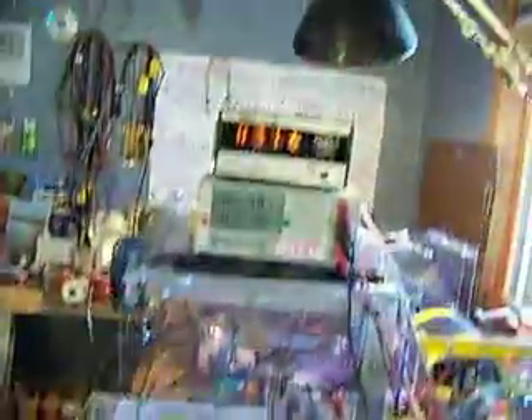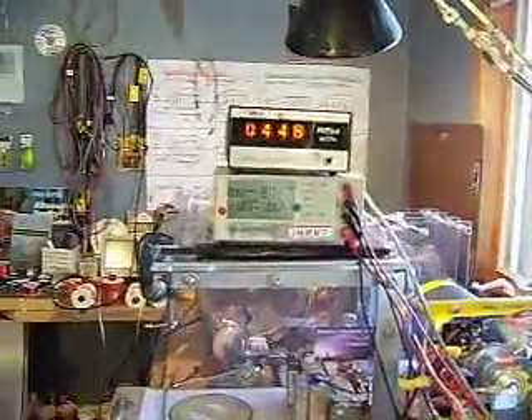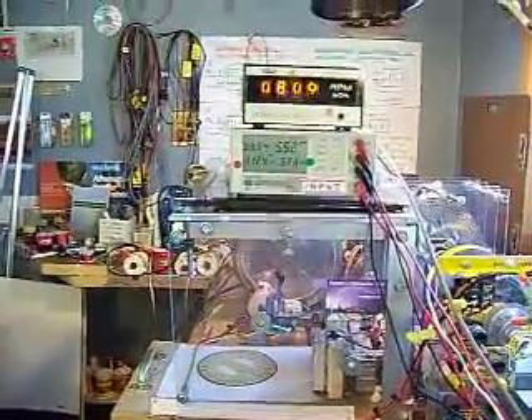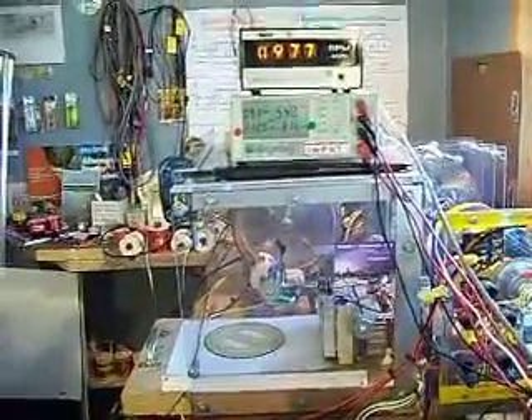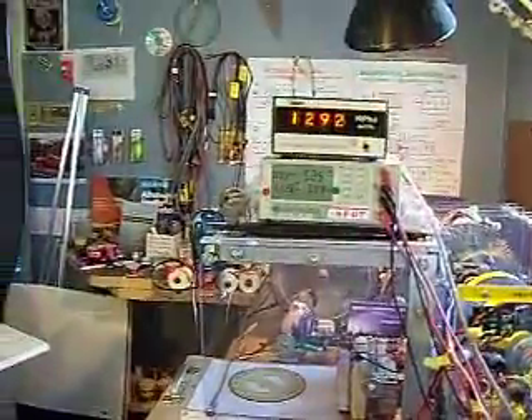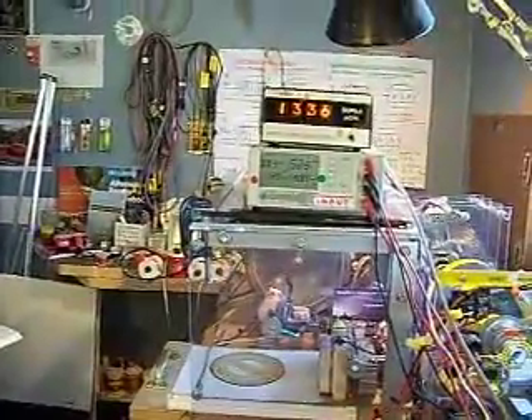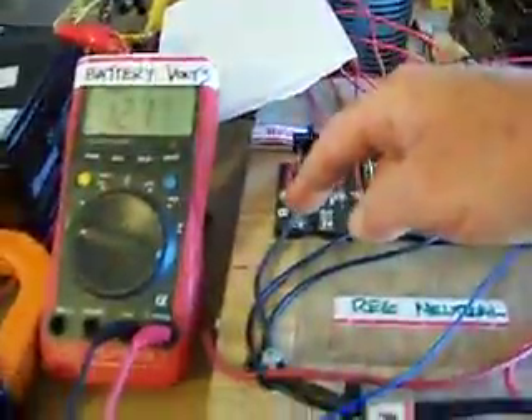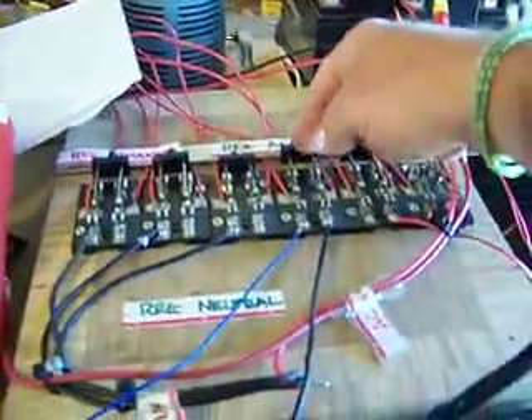So let's start it up. The operating speed I'm going with is 2500 RPM. You can go higher or lower than that, but I'm choosing that speed because it allows the motor to operate within its ideal current range. So let's take it up to 2500 RPM. Here we have the regenerative braking coil, the conventional coil, and the regenerative acceleration coil.